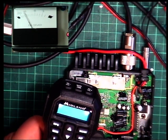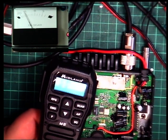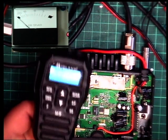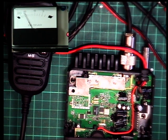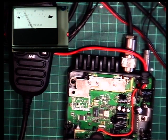We'll put a signal on channel 20 — I've put the signal on, it's about S4. There we go, and I'll take that signal off again. So there you go, it does what you expect it to do, but I think that's a faff — not my cup of tea. But the radio works all right. And we managed to get 3.6 watts out of it, which is about where we are these days with modern sets. But this is 3.6 watts into a commercial test set — if you put that on a CB type power meter, that probably reads 4.5 or 5. So it is 4 watts, as near as makes no difference, and it doesn't matter anyway. At least we've set it to the best of what it will do.